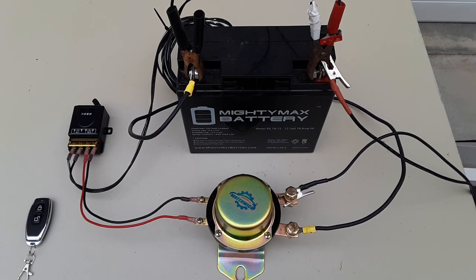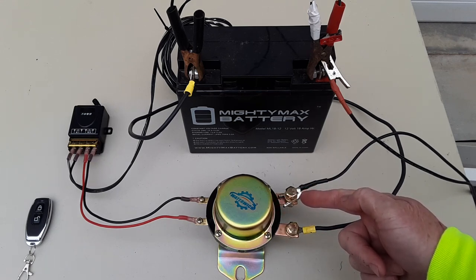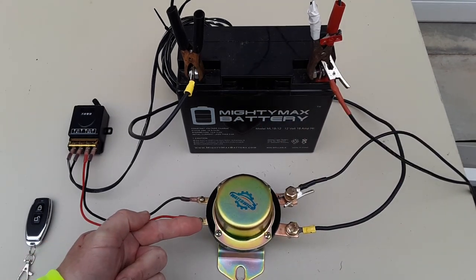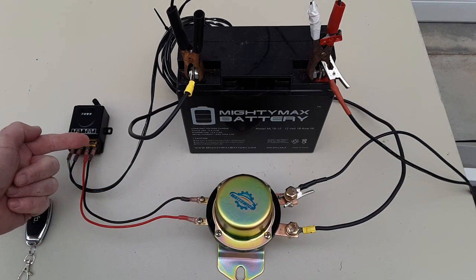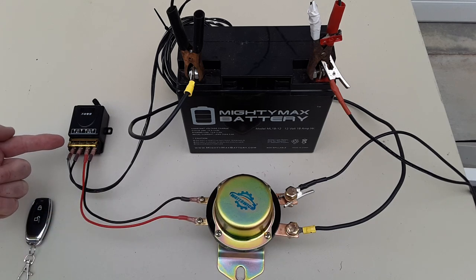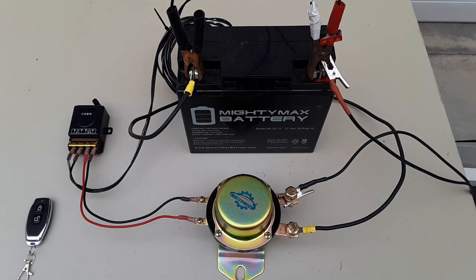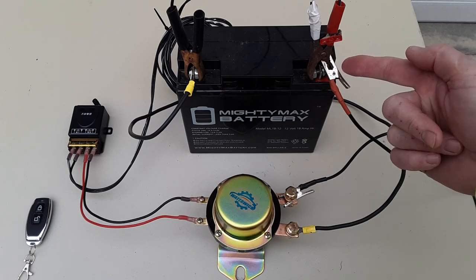This is my test setup for this project. Here you have your water witch, and you have the negative connection to your load — or in this case your trolling motor — and then also your other negative connection that goes to the negative of the battery. Over on this side, marked plus and minus, you have your positive and negative output in positions 3 and 4, which feeds the water witch. Then in positions 1 and 2, you have your positive and negative input to the switch, which is fed from the positive and negative of the battery. You also have your positive connection to your load, or your trolling motor.